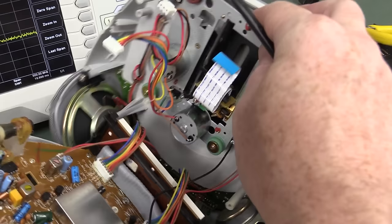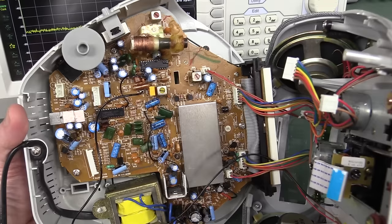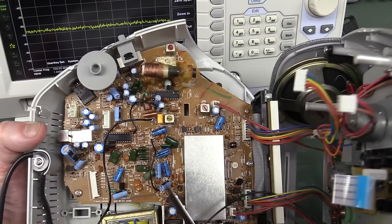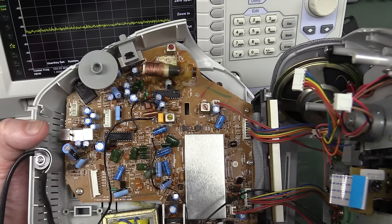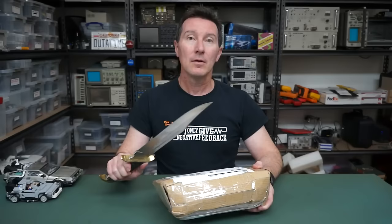Jeez, they put that on a vibration mount - I'm surprised in such a cheap-ass thing. It was either absolutely required to make it work, or they gilded the lily just a tad. There's actually a lot of parts that go into a little bedside clock radio like this. But they churn them out cheap as chips in China. If anyone's got any clue about how this turned into a pretty crappy transmitter - presumably the local oscillator doing it - please let us know. For those playing along at home, there is the Toshiba part number - I'll try and link in the datasheet.